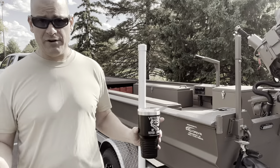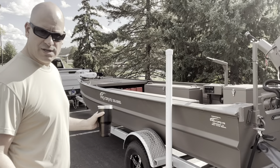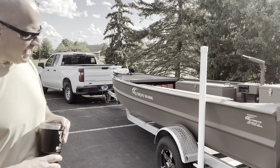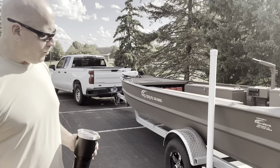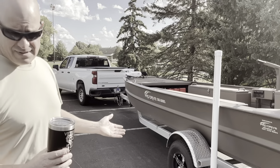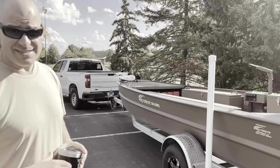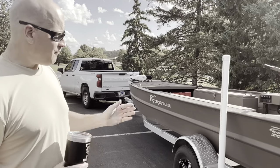Now it's a little bit heavier — that's the downside. There's always pluses and negatives. I needed something that could handle some of the bigger water out by the 10,000 Islands and I may take it out on some bigger lakes up here. This hull is 125 thou thick and it's 5086 aluminum. You can get 190 thou thick on it as well, but I didn't feel it was necessary and I didn't want to weigh the boat down anymore. 125 thou is extremely thick and heavy, and it's top grade marine grade 5086 aluminum for the boat industry. Everything is all welded on this boat.